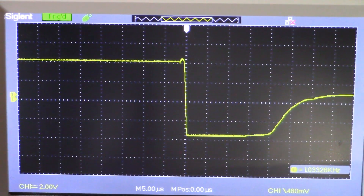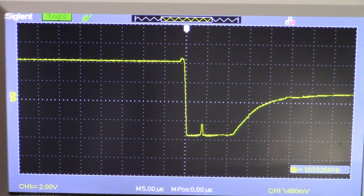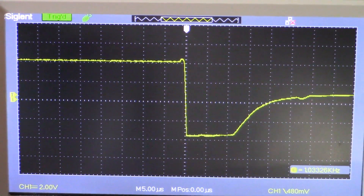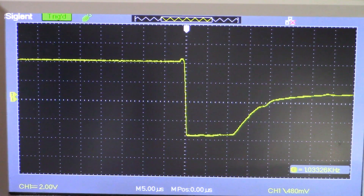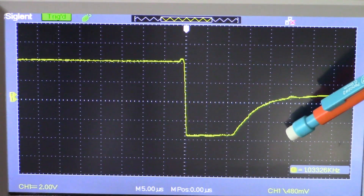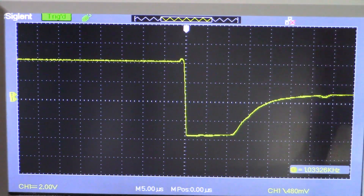That's one of the reasons why you really have to tune in your damping resistor. This isn't a particularly fast coil — I have maybe close to 12 microseconds on it — but that gives you an idea of what you should be looking at. We went from the extreme with tremendous ringing, to too small a value of resistance, which extends the saturation point way out and is not good for detection.